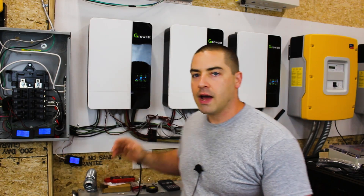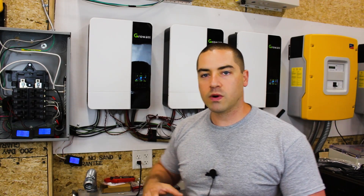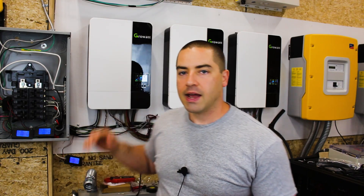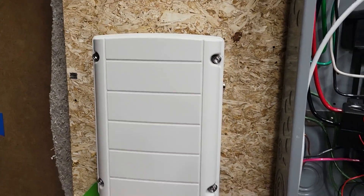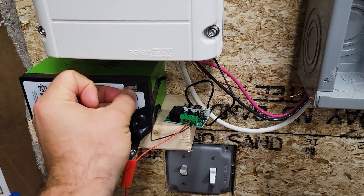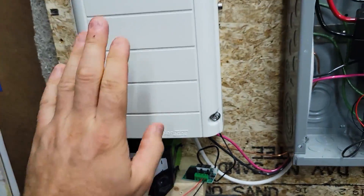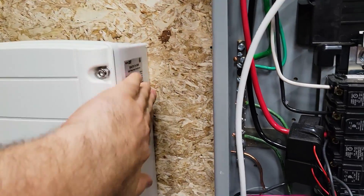One of the positives: I never had these actually get hot. I've put my hand on the case several times even when running the water heater and oven inside the house, and the outside of the case never gets hot. The fans do a good job keeping everything cool, though they do kick up in speed. Looking at the auto transformer, it's warm at 55 degrees Celsius — warm, but not bad, I can still put my hand on the aluminum.